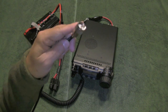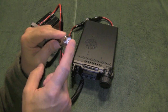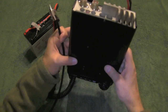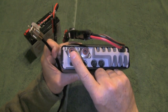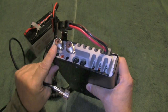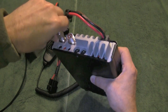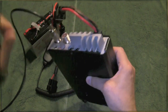Okay, we've got the antenna hooked up out back and this is the coax. This part is called a PL-259 — that's the name of this particular connector. That's pretty standard. On the back of the radio, there's a port for HF and then one for VHF-UHF — that's where we plug this two meter antenna in. That connector is an SO-239 which accepts the PL-259. Just plug that in and screw down the connecting collar and we are good to go.